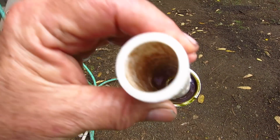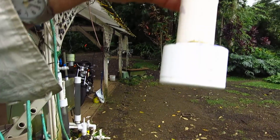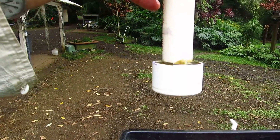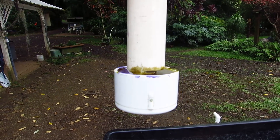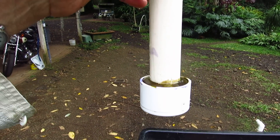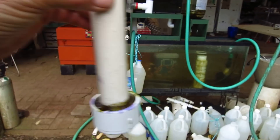I've cut some notches in there. I'm going to pour the water out - you see in there. So it's just going straight down and it's in there. Here's how it works: that cap's full of water. If the cap's full of water, I dip up some water there - you see the water is the valve. It blocks the air loop there. So any water coming down is going to bubble, and when the bubbles come out, that creates a partial vacuum. And that will set off your siphon.